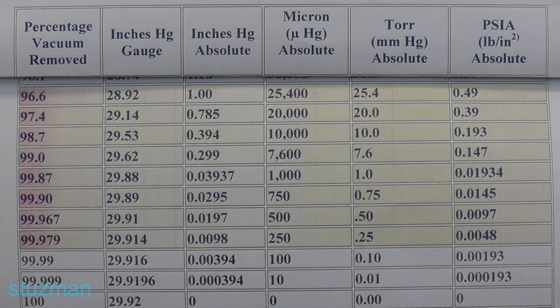The analog gauge just does not have the resolution or the accuracy that a micron gauge does. We saw that the pointer itself was about the width of one inch of mercury. We let it run and run, and we said okay, it's good — but when we looked at the micron gauge, we saw we were nowhere near close to being at 500 microns minimum. In my opinion, you want to be getting a micron gauge. That's what you want to be using to see what kind of air pressure is still left in the system.